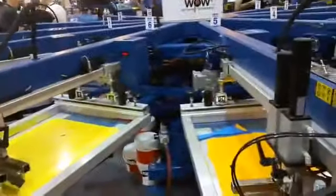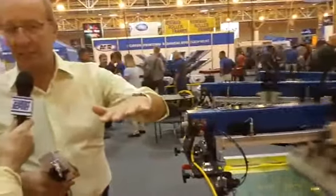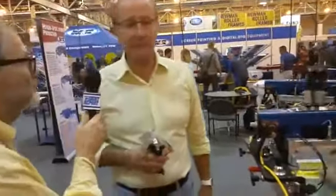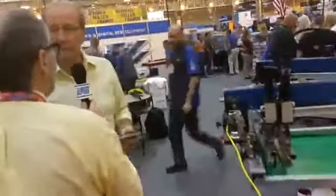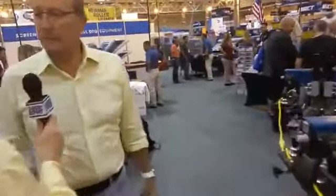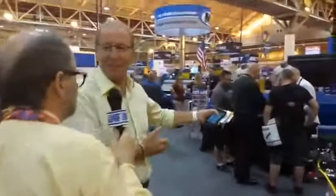The only attention has to be the flooding. The flooding has to leave a rich deposit of the ink because this is going to move down into the stencil, avoiding the clogging. So can we get your man to stop halfway so we can look under the screen and look at the build-up since this morning? Okay. I suggest to look at the last one. The last one is the most sensitive to the build-up.